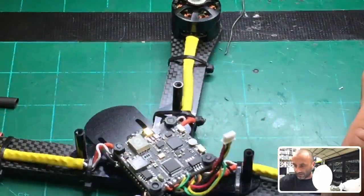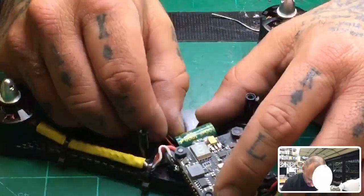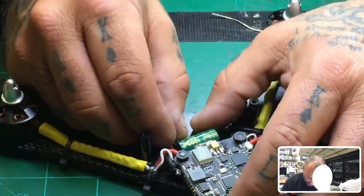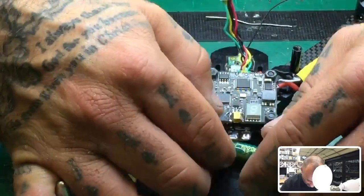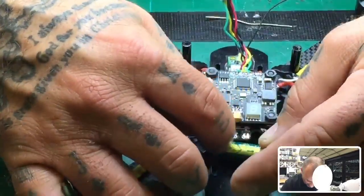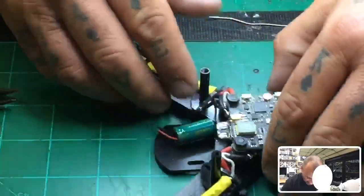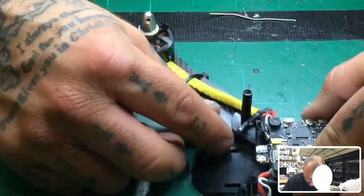So here's what I did. This is the capacitor that I'm using right now, right? That's a Sanyo 1000, it's a Sanyo 35 volt. I'm gonna lay it sideways like this because I know that's about as much room as I've got. And we all know the side that has these lines on it is the ground. Don't make the mistake I did, okay? Because it explodes and it's pretty damn loud. So you've got your positive here and your ground here.